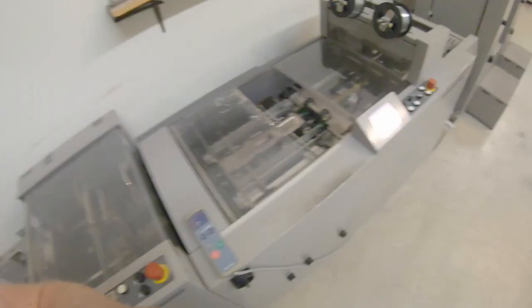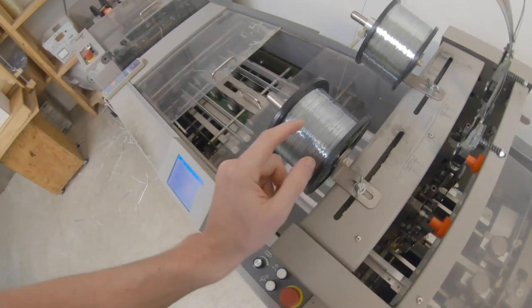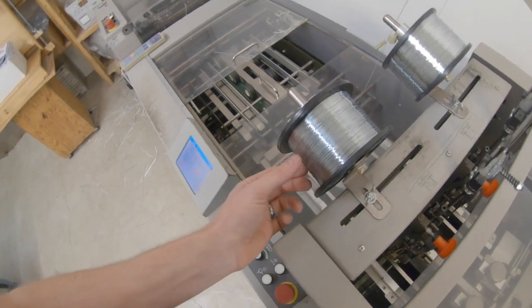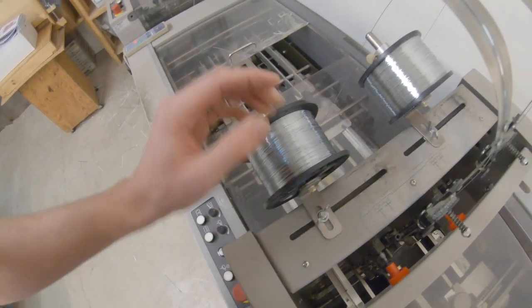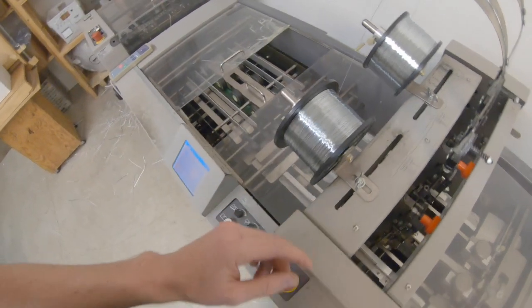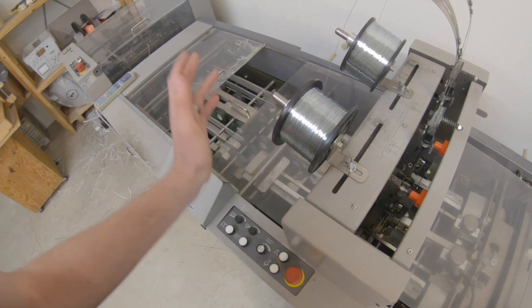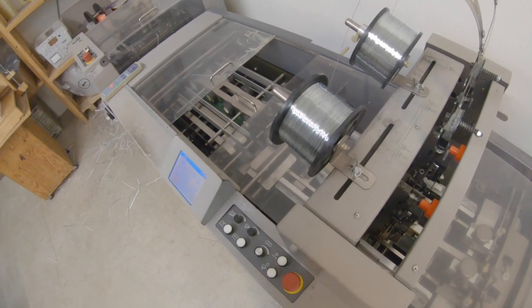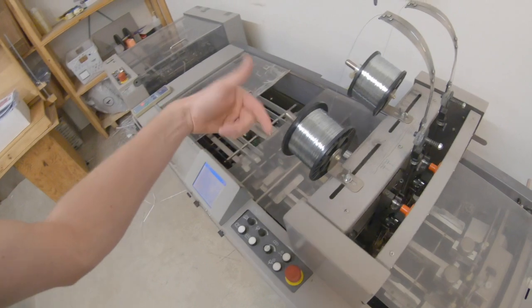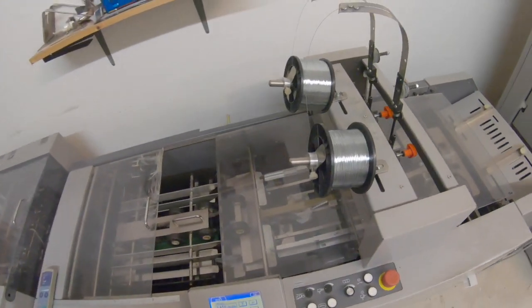something else I thought I should say. The other day I was having problems with this unwinding. It seemed that the wire was on there too tight, and that it wasn't pulling off right. So I lightly sprayed the spool with WD-40 and haven't had any trouble since. So if that happens to you and you have problems unspooling the stitch wire, give it a shot of lubricant.